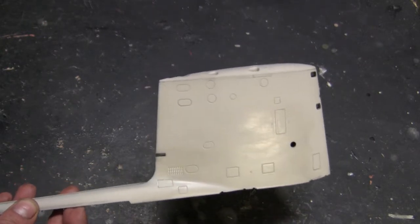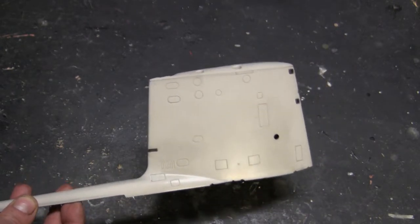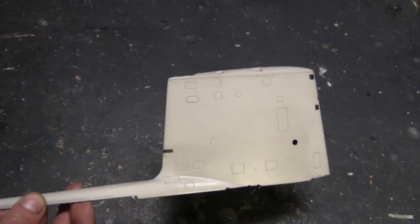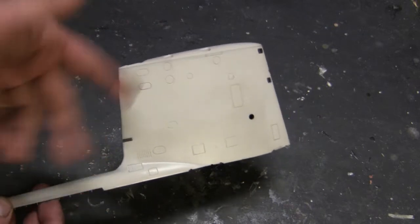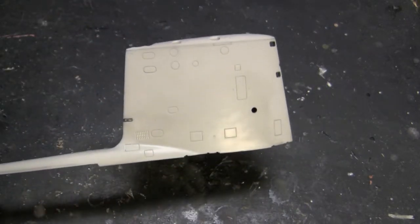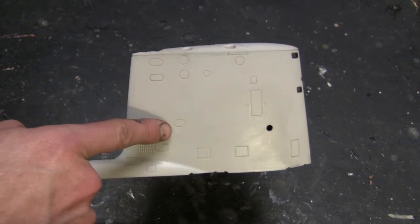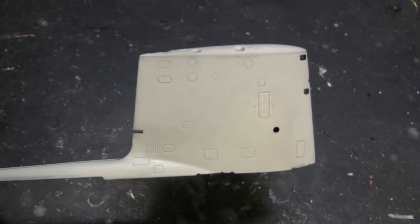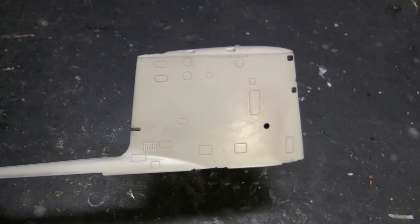They are covered in welds, they are covered in fasteners, and in many cases, depending on when the vessel was refitted, and with submarines and ships, it's like every 6 months or so when they get back to port, it goes into a shipyard where they refit the thing. A lot of times they'll make changes or repairs to the thing that deviate from the plans. For instance, it gets back, there's a piece of metal that's rusted out. They just simply cut that piece out, weld a new patch in place, and off it goes. Those are not going to be something that you will find in the plan books.